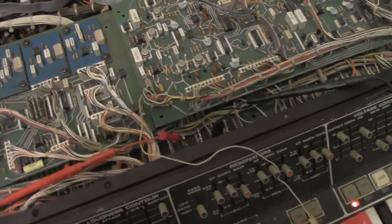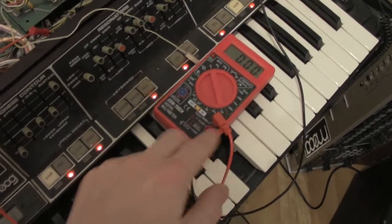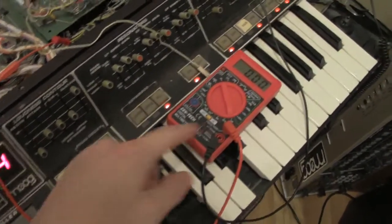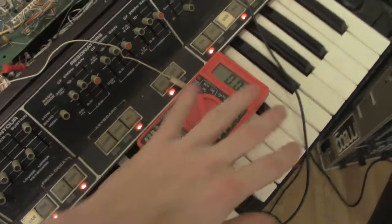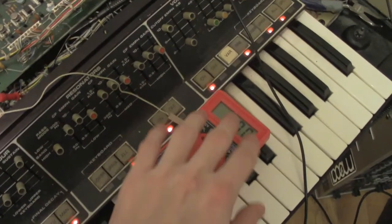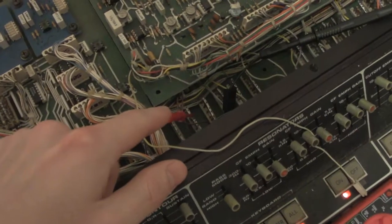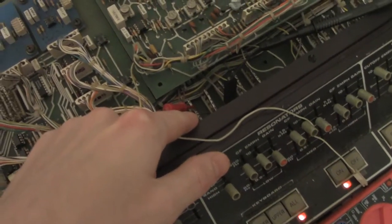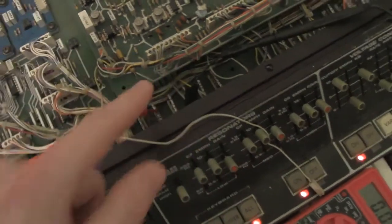But what I've got going on right now is I'm using this little meter here set to current. Basically what that means is these two leads are shorted together, and this just gives me a current reading, which it only reads in 10 amps, so it's way too high range for it to read the current I'm actually pulling. What I've done is I've connected between this resistor network and your actual switching IC to pin 5, and I'll show you why.